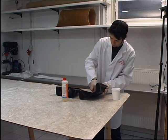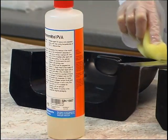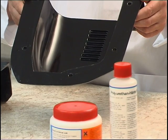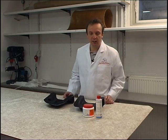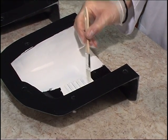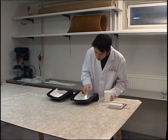Before the first component is laminated, the film release agent is applied. Next, we will be manufacturing the component in the female mold. The engine cowling is provided with a white overlay. In order to obtain this overlay, an overlay resin must be first applied to the mold. The overlay resin must gel before the glass laminate, consisting of two 163g glass fabric plies, is laid up in the mold.